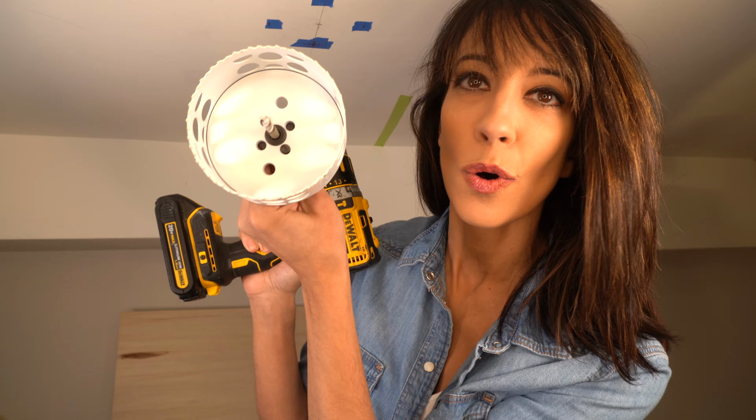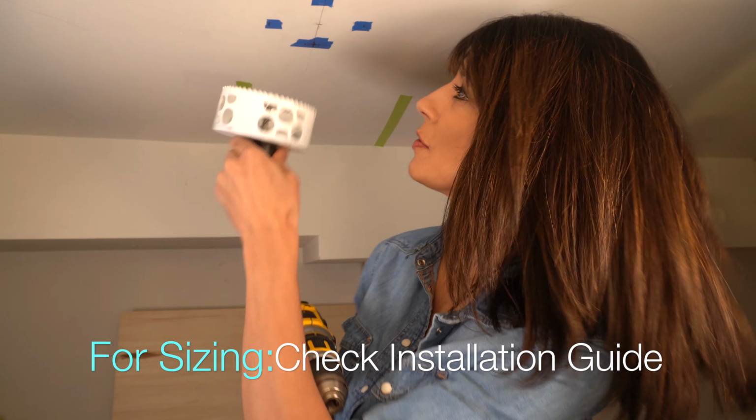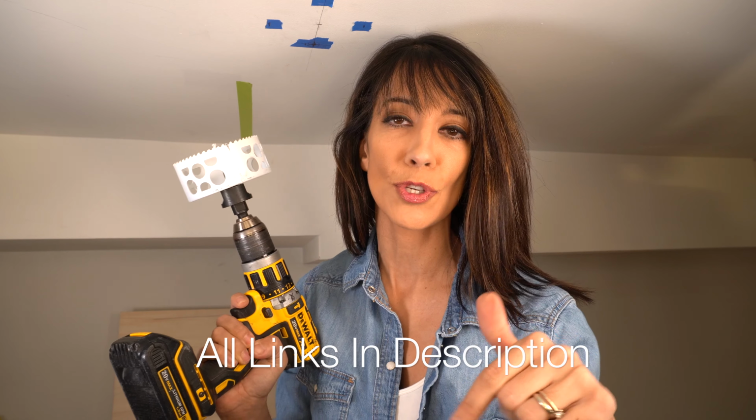The first thing we're gonna do is cut a hole in our ceiling with a hole saw. All you need is a drill and a hole saw. I'm using a 4-inch light, so I have this size correctly. I'll also link to everything I'm using today in the description. I know 6-inch is also popular, so I'll have them there.